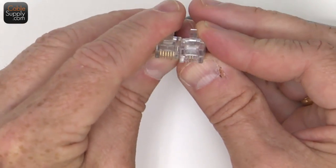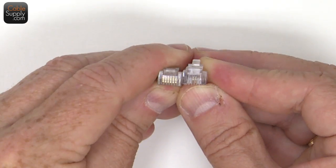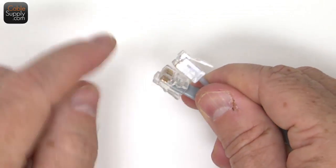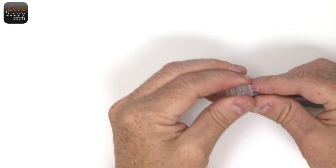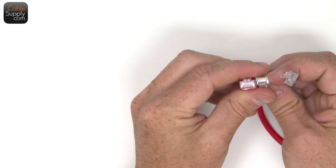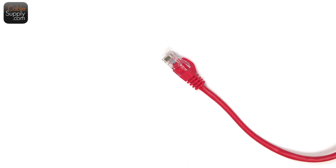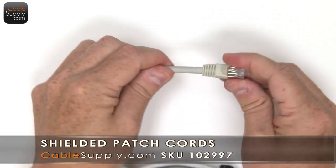But if you notice here, it's not just the fact that they have those silver lines in there. It's just that they only have 2 wires attached. They're all the same thickness. It's the same thickness, and it's the same this way. This way doesn't really matter that much. It's how thick it is this way, because you have RJ11 jacks, you have RJ45 jacks. Remember, that's a slang. They're not really called RJ45 and RJ11. They're called 6-position, 6-conductor, or the other way. And you can see the difference in these, how these are fatter and bigger, and use these for computers, these for telephones, everything else. And then we're not going to discuss it in depth today, but here is a shielded computer cable, and there's a reason you use shielded.